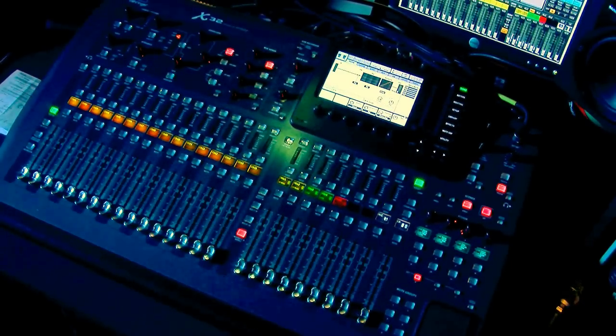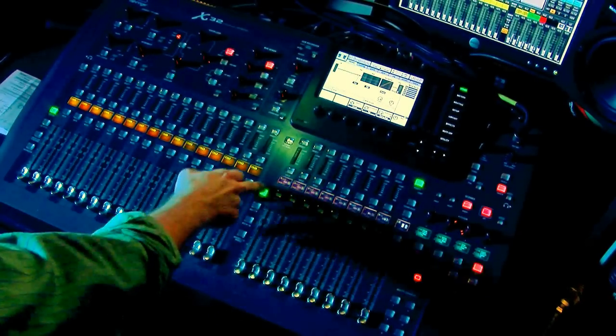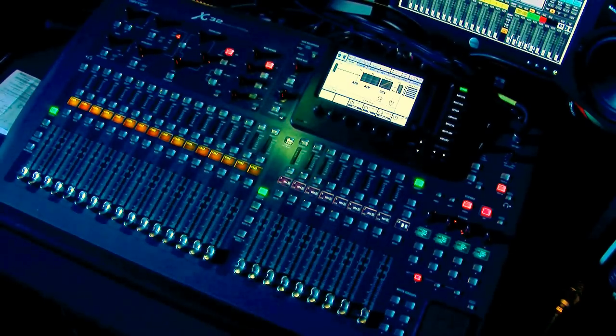I have my board completely initialized so it is very stock — the factory configuration you would get it from Behringer. I am upgraded to firmware 1.11, and you'll want to do this because in firmware 1.10 they added the Butterworth filters in the matrix section.